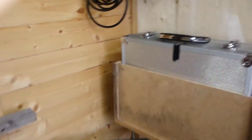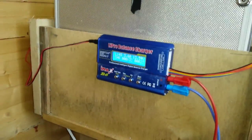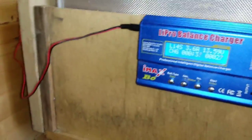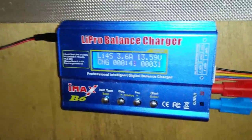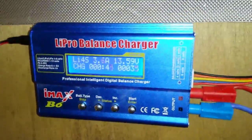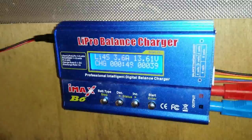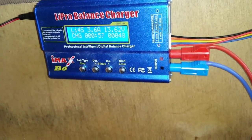I'm going to stick this to it and show you what it looks like at the end. Right, there we have it — I've just glued the board on the back there where it's not going to short out. I don't know if I'm going to keep it like this; I'll probably change this pretty soon because it's awkward. I basically hot glued the meter onto the IMAX B6 onto the back. I'm not proud of this, but it works. Balance leads and the banana plugs go into the side, and we're charging at 3.6 amps.